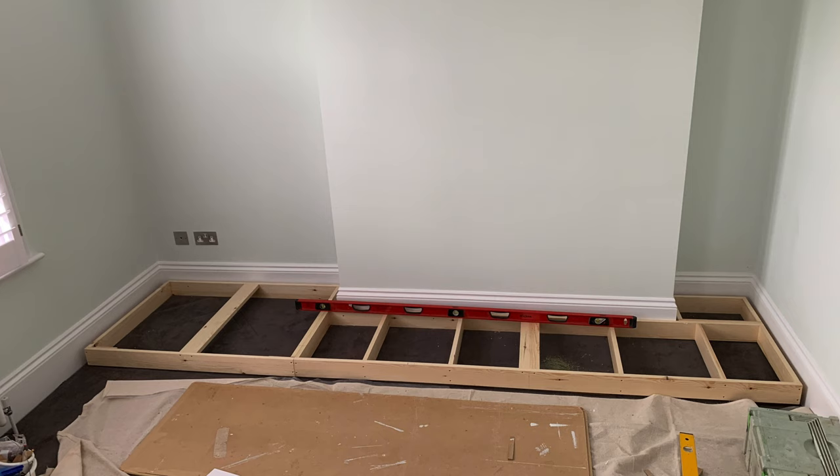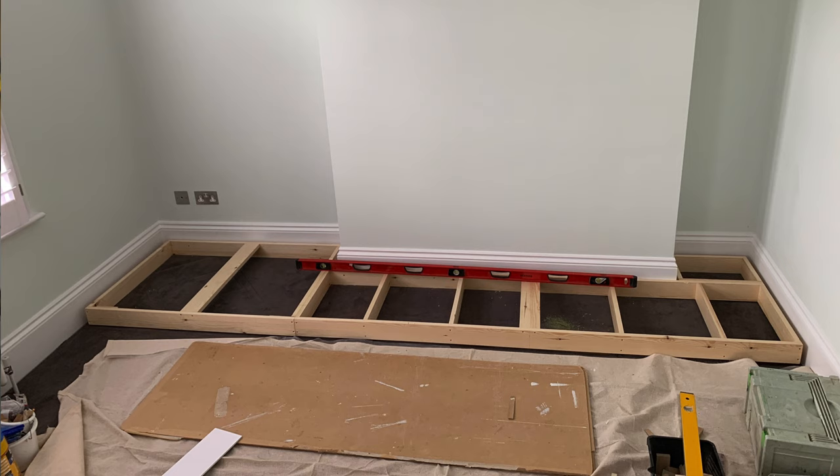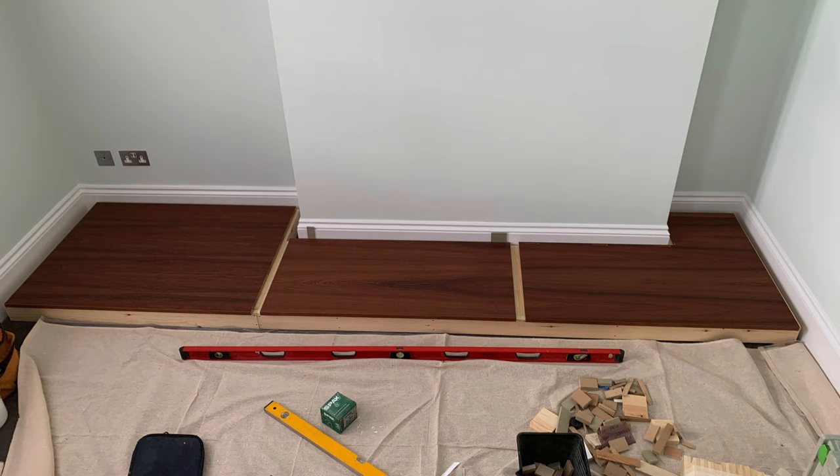It then took another half an hour to 40 minutes just to get all my gear in. Thankfully the room had been cleared, and this was actually the first time I'd seen the space empty. Surprise — as well as redecorating the room, the clients had shutters fitted to the windows. I'd allowed the carcasses to come in from the walls slightly to clear the windowsill on the left-hand side, but the shutters stand slightly proud of this. So the first thing I do is assemble the plinth and get it roughly leveled — I know from a previous visit that the floor falls away to the right-hand side by about 20mm.